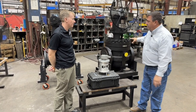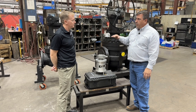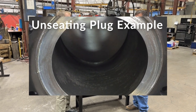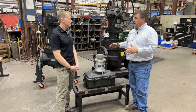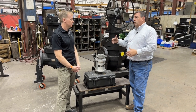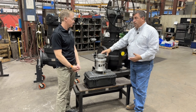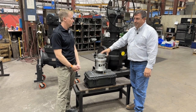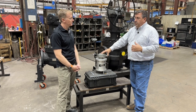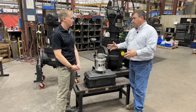Depends on the design of the valve, of course, but a lift and turn plug actually doesn't have a flat torque or force requirement. Because it lifts, it actually requires quite a bit of force to get out of the body. Then once it's elevated, it's essentially free floating. So torque or force requirements drop off the page until you actually go back down in the seat. The design of the unit itself is built to mimic the force requirement of the valve it goes on. So it works quite well. Again, it's very easily automated. In fact, most of our InnoMATs, we have probably 500 here in North America installed, and they're almost exclusively automated. So ease of automation, reliability, repairability over the course of time, those are all in the forefront of our design.